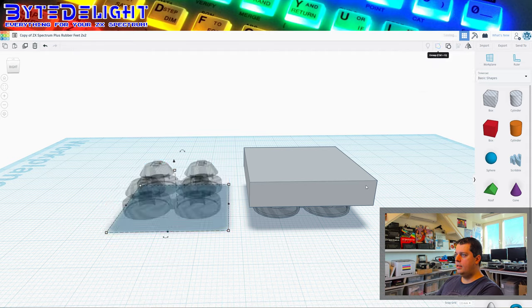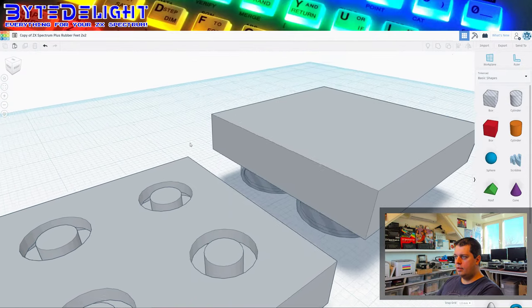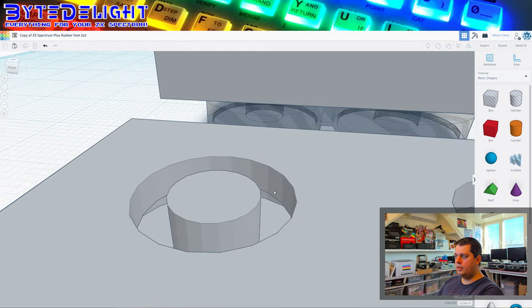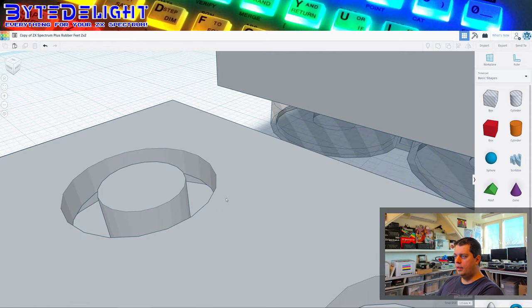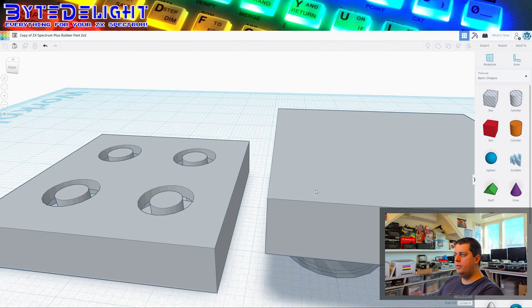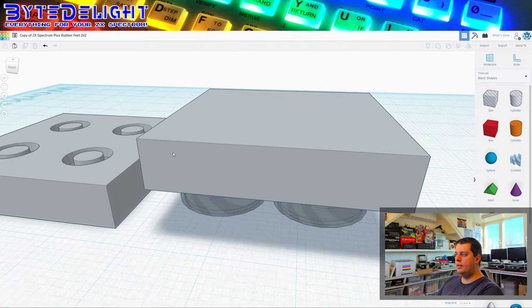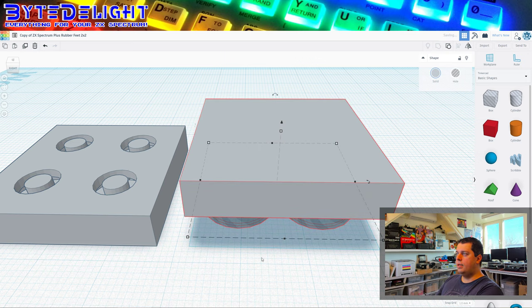We have the four rubber feet duplicated and this will make a hole in the part — look at that, that's the hole on the bottom. The hole goes underneath the steel, which could be a bit tricky because I have no idea if it will work with molding. I know a bit about molding — you need an outlet because if you push in some stuff and there's air in the holes already, you will close all the sides and the air won't get out. So you need some holes for the air to escape.